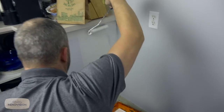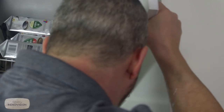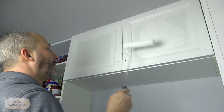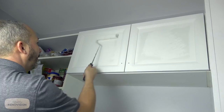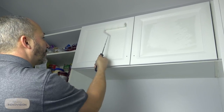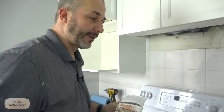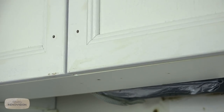This is like a really sticky paint — you don't want to get it all over yourself. In order to finish the coat, I put a little bit of paint on each of the inside of these doors and I want to back roll until the coverage is really nice. Because we're dealing with natural wood, there are some areas where at the joint you can see some light brown staining coming through. Generally speaking, that's just the sap from the oak.